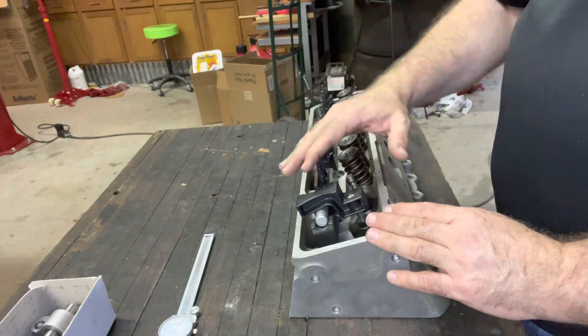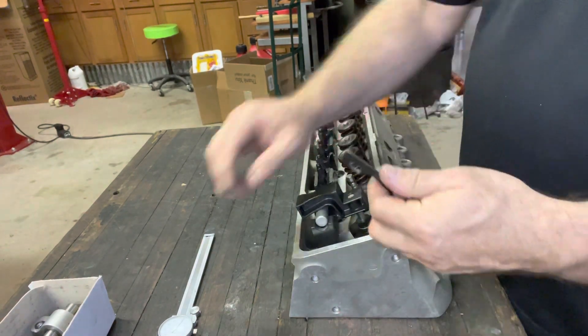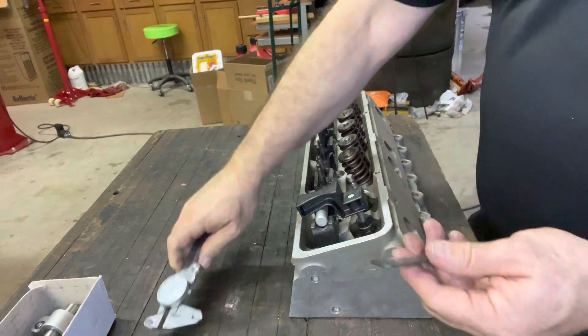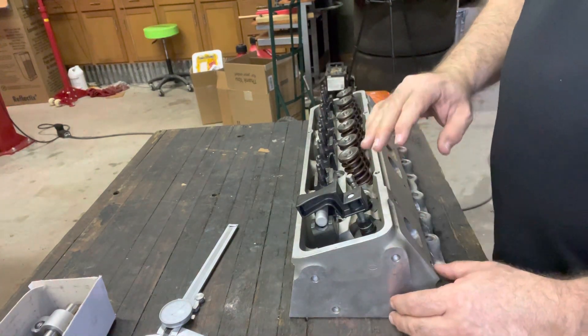In order to do that you'll need to lower the stand. If you need to raise the stand, they do make shims in varying thicknesses to get it up there. This is about a 58 thousandths shim that we don't need in this case — it actually worked out to be absolutely perfect in this application.